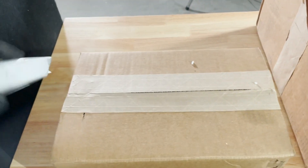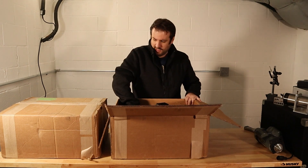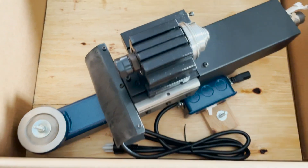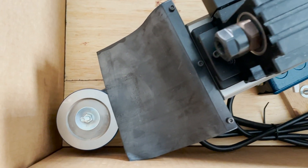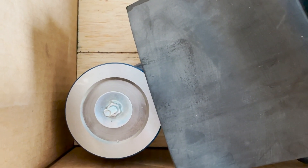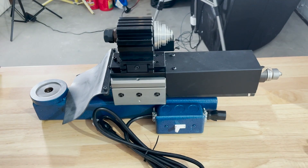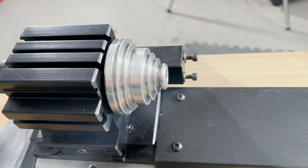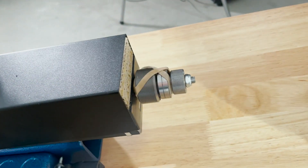In this box is the motor for the spindle. Now we're ready to lift the Z axis out — you can see it's bolted to this piece of wood, so we'll have to take the bolts out. One last bolt right in the rotating plate there. Here's the Z axis — there's the switch to turn the spindle on, this is the rotating column, here's the collet nut, there's the pulley for the spindle, and the end of the Z axis ball screw. We'll clean that up in a minute.